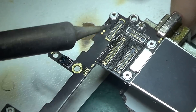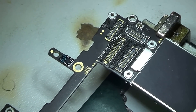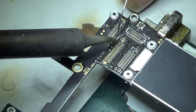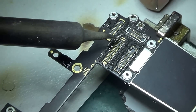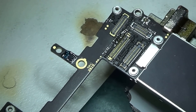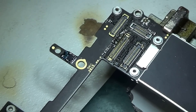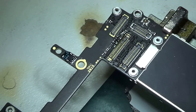I'm just trying to tin that pin, which is kind of impossible. So what I decided to do instead was tin the pin from the top where the LCD connector goes, so it would be easier to make a jumper through there.